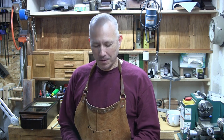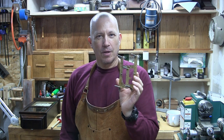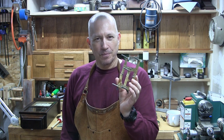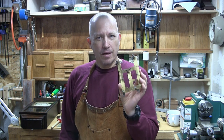When I cleaned all these parts — and they were pretty dirty, if you saw the first video when I took the movement apart — I'm probably going to be skipping a few steps. I'm not going to be doing any pivot polishing or anything like that. Many times when you have an old clock and it stops running, all it needs is to be cleaned up, re-oiled, and it'll keep going unless there's really something wrong with it or severe damage. I looked at the pivots and they're still pretty good, so I'm not going to sweat about any bushing work unless I find something excessive. Basically this video is showing people how to put the movement back together.